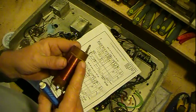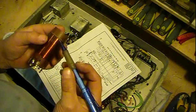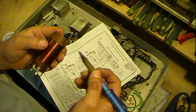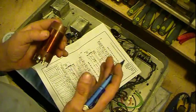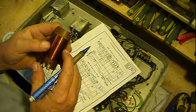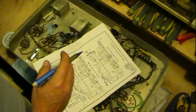This is actually called a gimmick, but most gimmicks you'll see in a different form where they'll actually take a wire like this and wrap it anywhere from 1 to a couple dozen turns, depending on how much capacitance they want around another wire. But they're called gimmicks, gimmick capacitors.